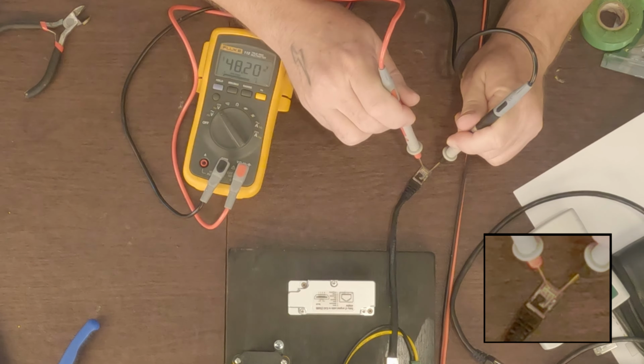So what I did is I went on Amazon and I bought a different step-up transformer, and this one is up to 56 volts instead of 48. So by the time you get the voltage drop there, we're going to be a little bit positive of 48. And from what I understand, Starlink themselves are actually running 56 volts. So although the standard's 48, it's tolerant of a higher voltage than that. So that's what we got. I put this in. Fortunately, it's the exact same form factor. It looks exactly the same.